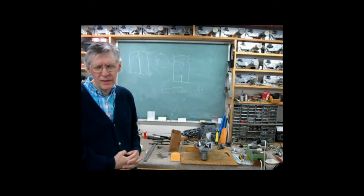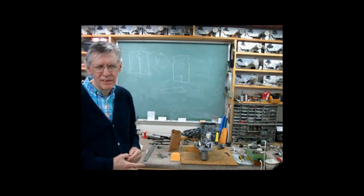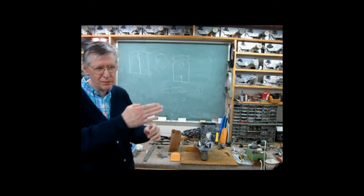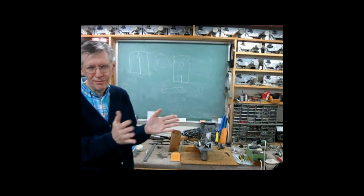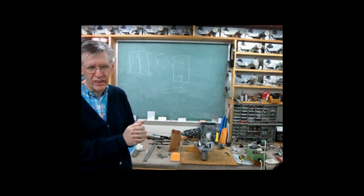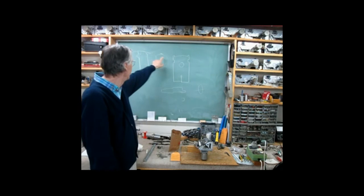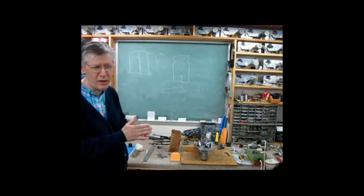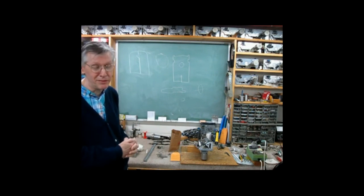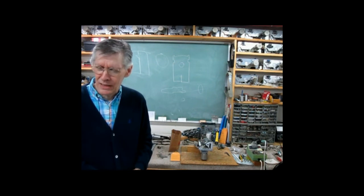But having a refurbisher do this is not very practical for a number of reasons. Number one, namely, is you have to have enough tip to begin with, and then at the time that it becomes worn down to the midpoint, then they would have to reorient the radial adjustments from this side of the lobe to that side to get 3 more mils. And they're not going to do that, it's not practical to do that. But in our case, it was practical because we were doing all this on our own by ourselves.